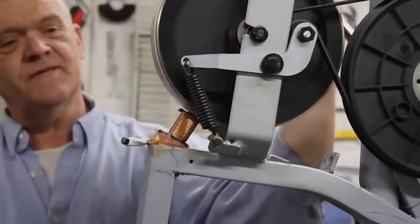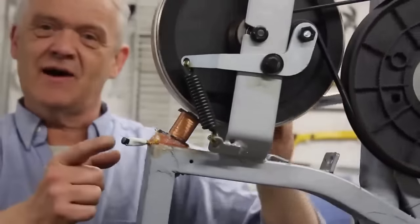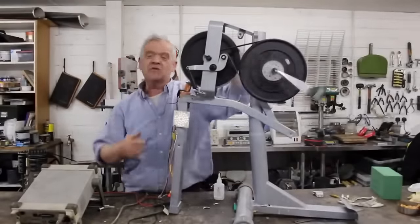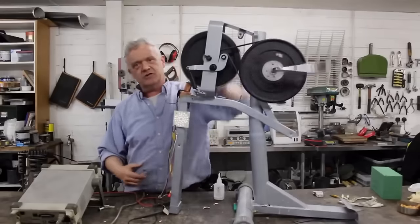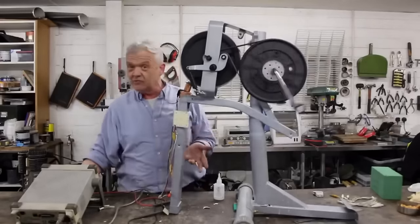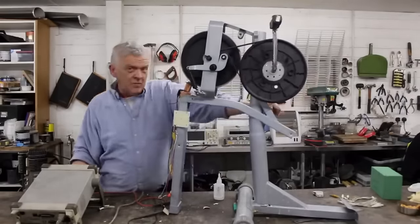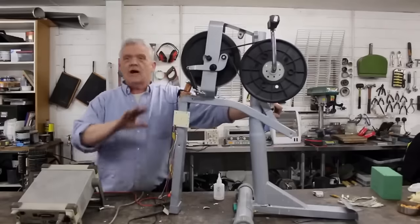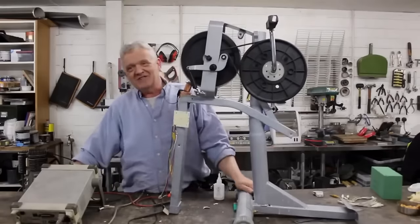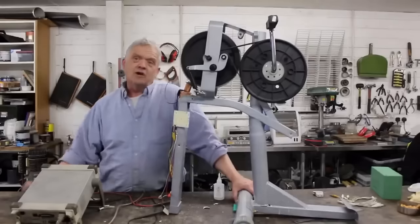I've put one coil on it to test it, so we can give that a spin. It makes a nice noise and it's lighting a light - absolutely no problem at all. It's producing about 12 watts for a single coil. So if I want 120 watts I put 10 coils around there and connect them in series or parallel depending on the voltage I want. Given the army field generator is only about 80 watts and you've got about 60 watts per arm, 100 watts is about what you can get out of such a thing. All I've got to do now is add those other coils and put on voltage regulation.